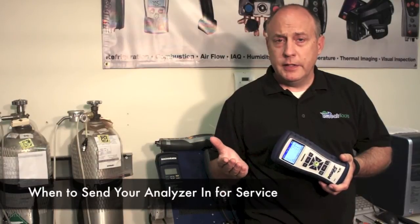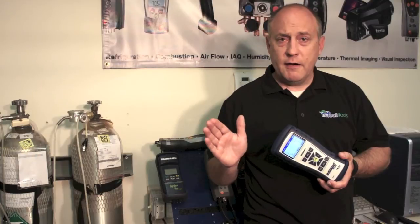Now that we've covered the typical field problems, the question always comes up: how do you know when it's time to send your analyzer in? Analyzers today are designed to be plug-and-play and a user can typically order cells, swap them out, and have the thing back in operation in a few hours. However, with the Testo 327 a firmware update may be required to accept the new cell. Both Bacharach and Testo analyzers should be verified after new cells are installed to make sure O2 and CO are in calibration and there are no internal leaks. While a field technician can check a voltage meter against a known source, verifying test gas readings really requires our equipment and we can do it for a very reasonable cost.